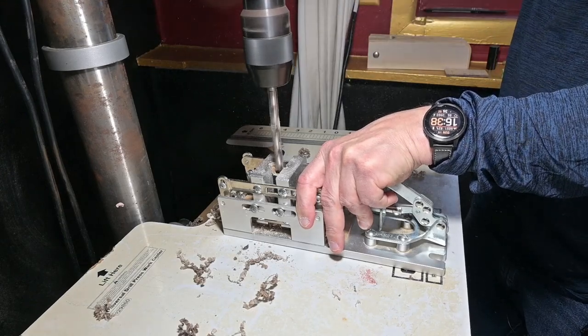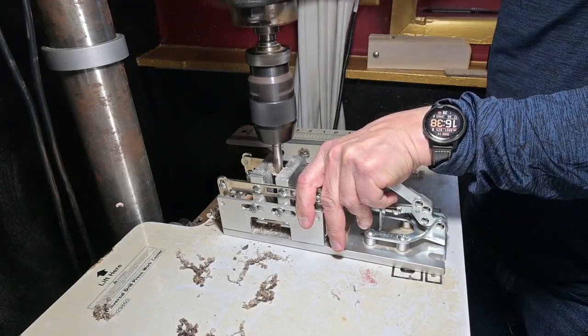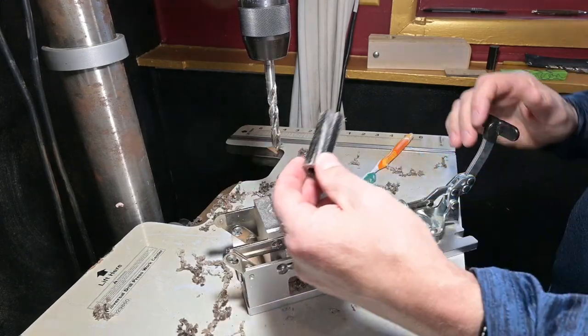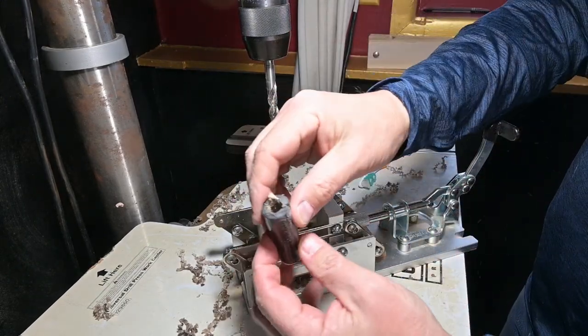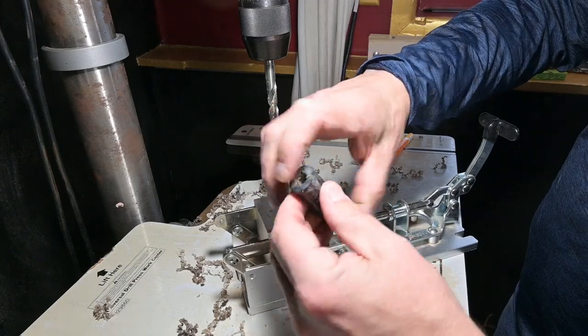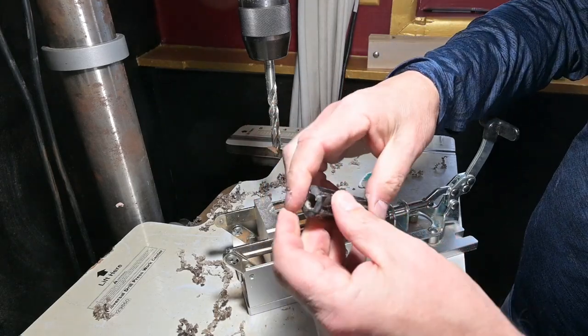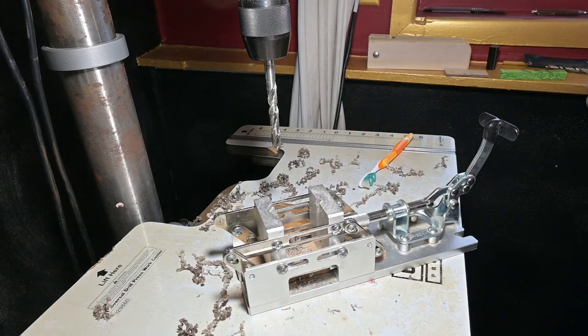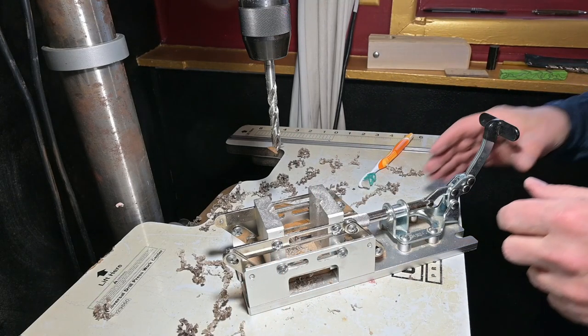That's what you gotta be careful of. Those brad points catch like that. Hopefully we didn't get a blowout. And it cracked. So it caught, and this one is no good. So I'm gonna have to go cut another one. Terrible, terrible. Got too hot.